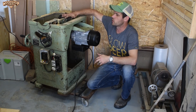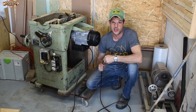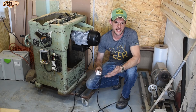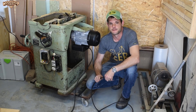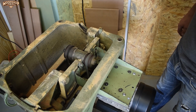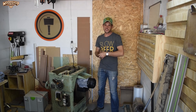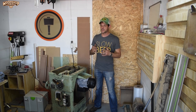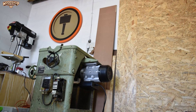That's the motor installed and everything looks in order. For the purpose of testing it I'm going to power it straight from my wall socket, which is obviously not how I'm going to be using it. I still need to replace the direct online start or safety start switch, as this one is still configured for 380 volts and I'm obviously going to be using 220 volts. I will do that when I do the final assembly of the saw after refurbishing all the components.